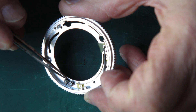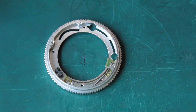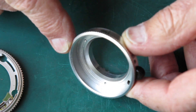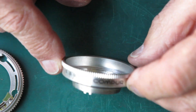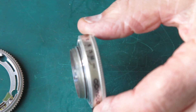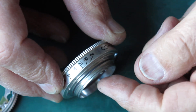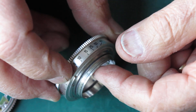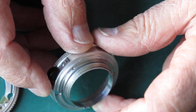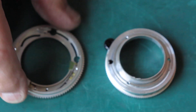Even though they're just a fairly narrow piece of gear, they've got an area where they catch each other so they counter-rotate, and that's what's required to move the depth of field pointers in this sort of motion. One is set lower than the other so it clears the bottom one. These parts need to be cleaned — you can see there's a fair bit of dust and grit and rubbish in there, and all this outside surface looks a little bit tarnished.